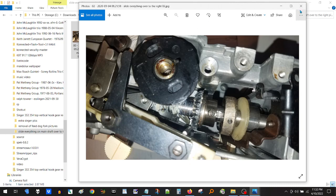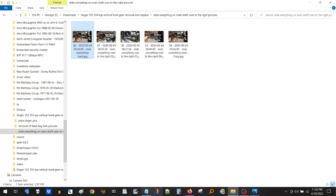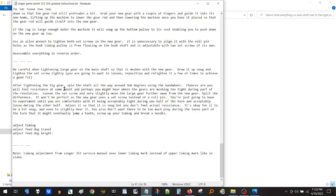How did I word it? I worded it very artfully, I think, in the description. Down here, I wrote, after tightening the big gear, spin the shaft all the way around 360 degrees using the hand wheel. Chances are you will feel resistance at some point, and perhaps you might hear where the gears are meshing too tight during part of the revolution. Loosen the set screw and very slightly move the large gear further away from the new gear. Split the difference. It won't be perfect as the new gear uses a set screw instead of a roll pin. You're just going to have to experiment until you're comfortable with it being acceptably tight during one half of the turn and acceptably loose during the other half.